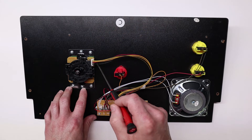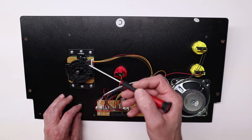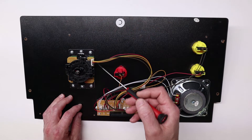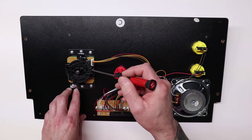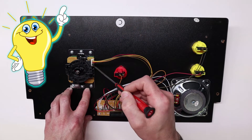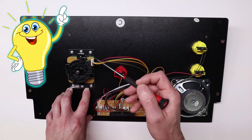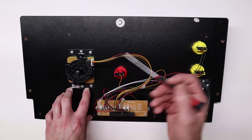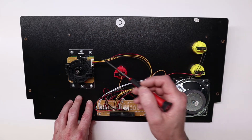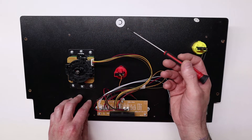Let's dig into this joystick connector. We can see right away that there's a five-pin connector here, and that's kind of strange because I would think you'd only need three pins — a common and one leg for each micro switch, the left and the right. So why there's five here, I'm not sure, unless they use the same joystick connector for a game that has four positions: left, right, up, and down. That would make sense — they'd have a common, a left, a right, an up, and a down. Rather than make two versions of the joystick actuator, you just make one, use the same harness over and over again, but only use the pins that they need. So we're going to dig into this and find out what's going on.